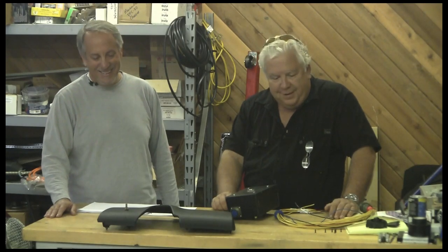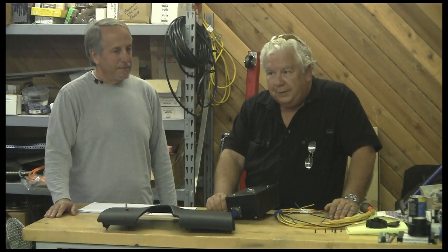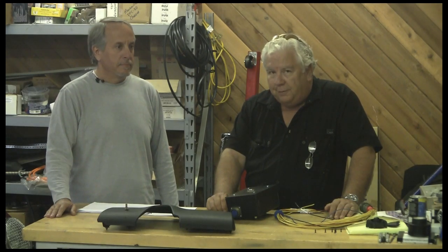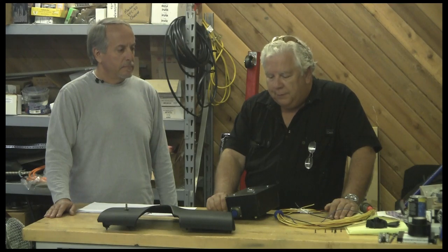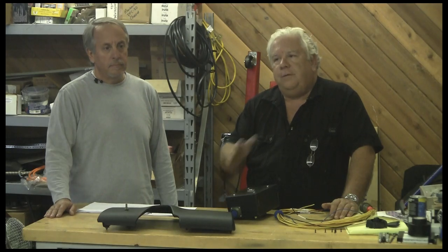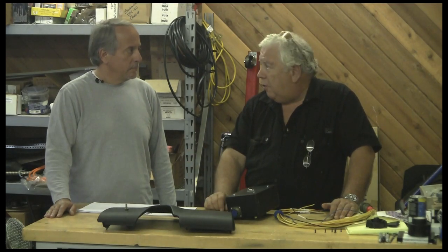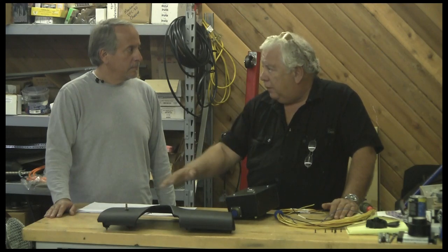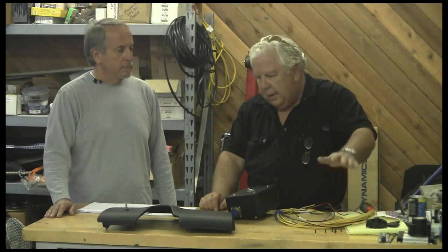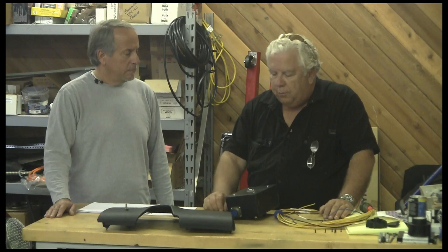Working in a garage in Missouri, we just don't get it. But instrumentation is kind of important. These battery systems are a little touchy. They're not like a lead acid system or a NICAD system where you have a fairly linear discharge curve from one voltage level down to another. We've got this sharp drop, then a very flat discharge curve, and then another sharp drop.